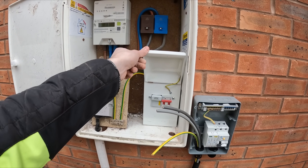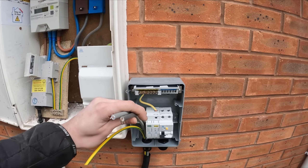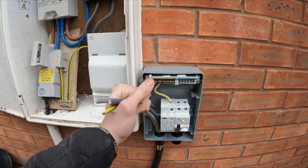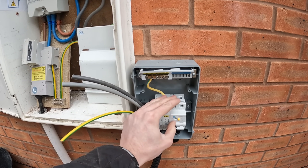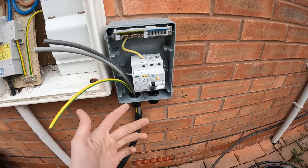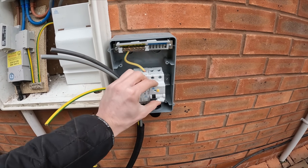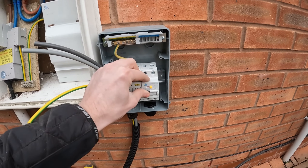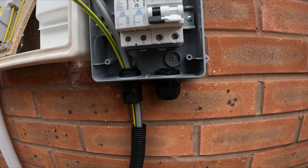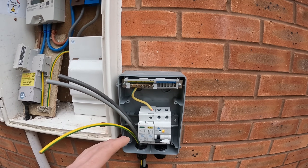This here is a KMF switch. Because it's a new build I presume there's going to be a 63 amp fuse in there. On this side we're going to wire the 10mm earth, 10mm live, and neutral all in here. You're fine using 10mm because it's only powering the one circuit and it's a 40 amp. You've got mains cables coming in and then 4mm EV Ultra — perfectly acceptable. You've got your Type 2 surge protection device, your CR40 RCBO and main switch all built into one. If you trip the RCD it will trip as one unit — it's like an RCBO but it's your main switch as well. It comes with nice pre-insulated busbars — just check everything's torqued off.